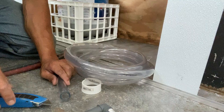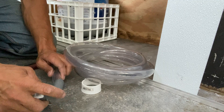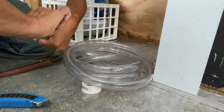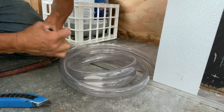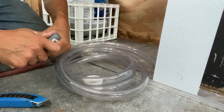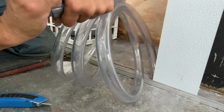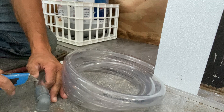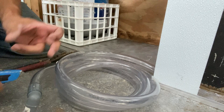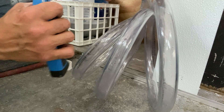I know I'm going to have the elbow here. On this one, since it's not all the way up yet, I like to get it as far in as I can and just spin it. I'm up flush right to there. I'm going to cut that off about an inch more because I just want it to connect and be as close as possible to the next fitting. So I'll go about an inch right to there and it'll slide on close to each other.